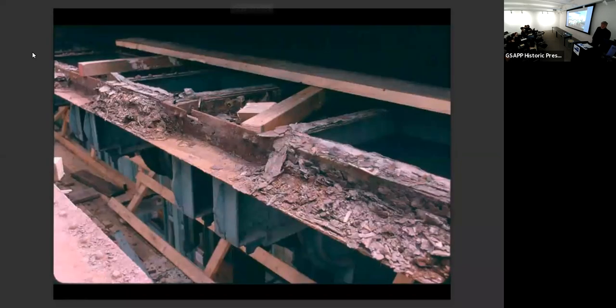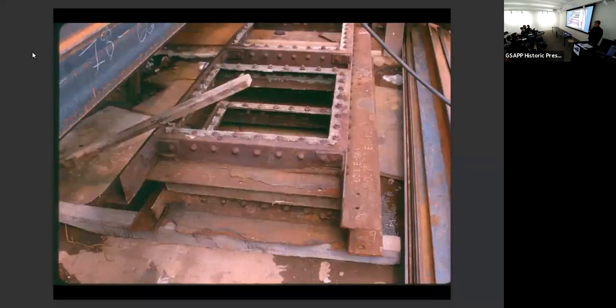There's actually a lot to know about hot dip galvanizing. You would think, given the level of rust that you saw on the front of the building underneath the gutter, that these pieces had to be completely replaced. But in fact, most of what you're seeing is pack rust that's much more voluminous than the steel underneath it. And so with pieces like this, when they came off, disassembled often, you can see that really it's only that front angle, that one angle, that needs to be replaced, and that was typically the place.